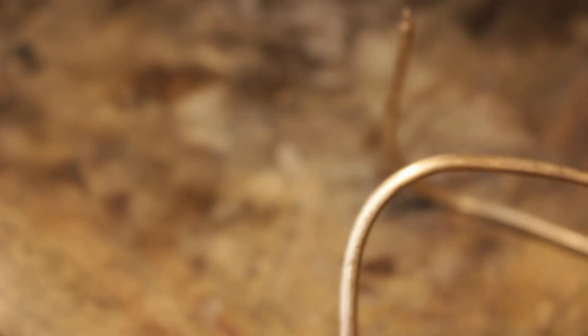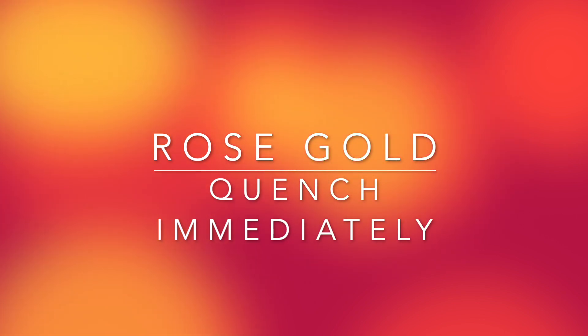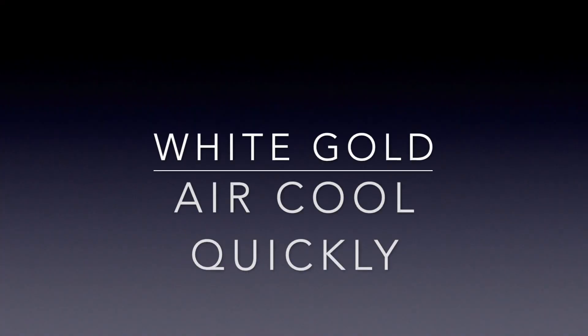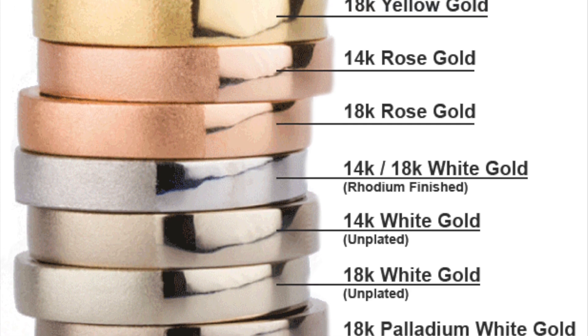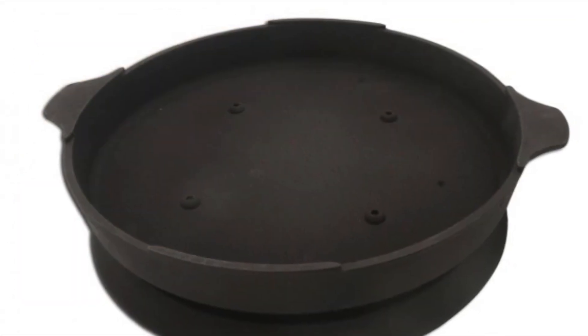The standard annealing technique works for most silver and gold alloys, but some people say that red gold or rose gold should be quenched immediately — don't air cool it. And some people suggest that white gold with high nickel content should be air cooled quickly but not quenched in water. So if you're working with those metals, try those specific tips.